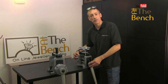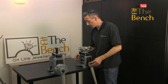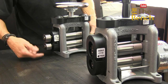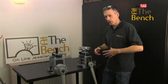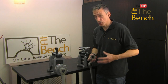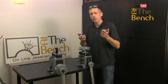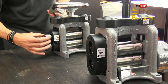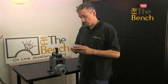The advantage of having a roller mill with these little extension rolls on the outside is that you can take them off and replace them with other different grooved extension rolls. Primarily the bottom one is always flat, as you can see here, and the top one has these little grooves in. I've got an old mill in my workshop downstairs — about 30 years old — and I've got four different types of extension rolls for it.